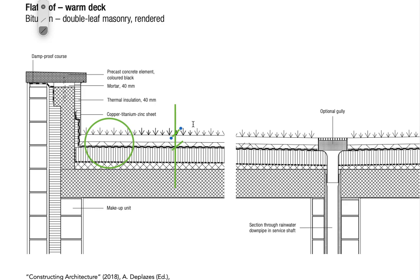Any other type of roof would probably have some sort of cover. It could be accessible — something like garden tiles or a decking situation, where you'd have some kind of sub-construction with decks sitting on top, or some sort of cladding. These elements would perform as a protection for the waterproofing and insulation below. But in this case, the green roof is performing as that protective layer.